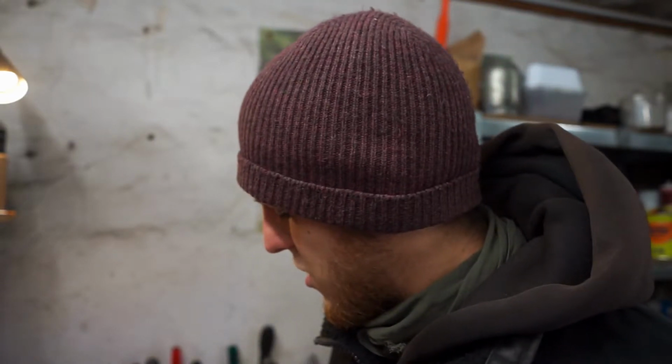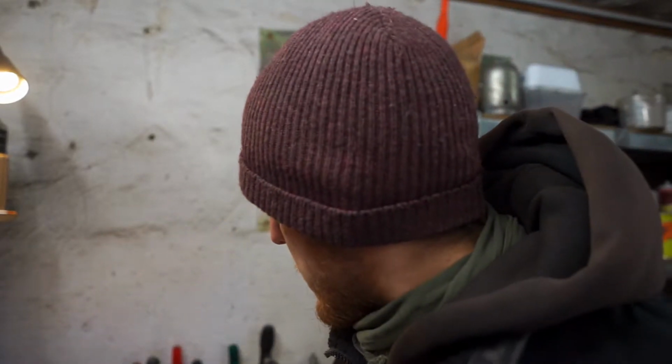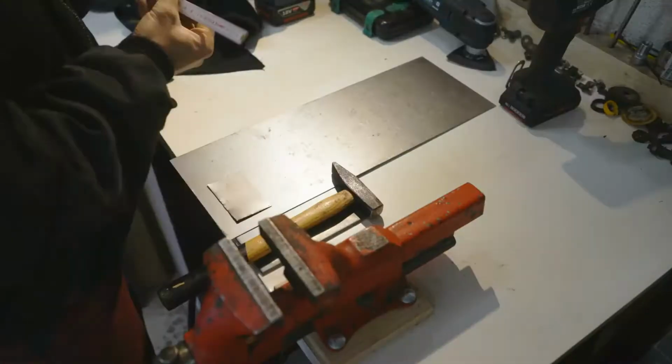Today I would like to prepare the metal sheets that I have to weld on the two spots on the underbody of Oleg. So I have a 0.75 millimeter sheet and a 1 millimeter sheet. I'll build the two little plates about this size and then paint them with the zinc spray from one side, so that the two sides of metal that are lying together are a little bit protected against corrosion. Then let it cure, and tomorrow I can start welding these plates in place.